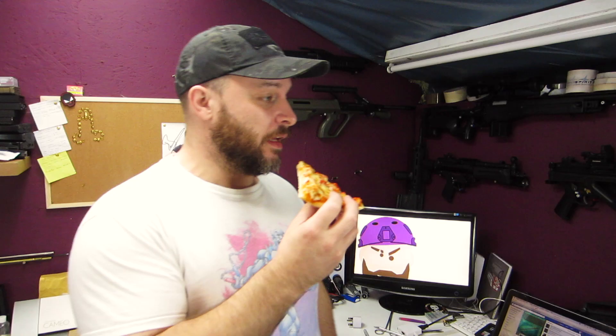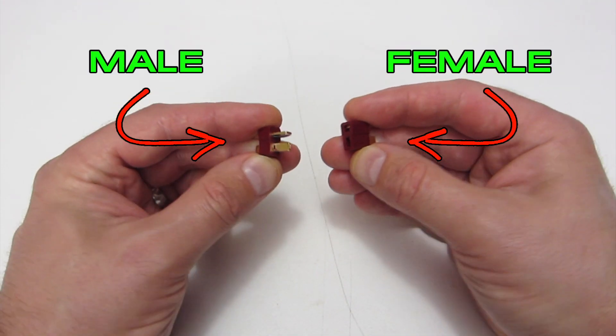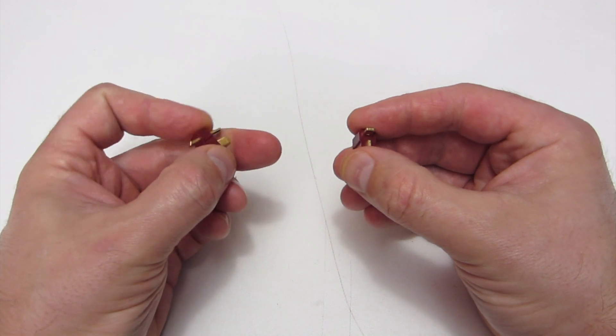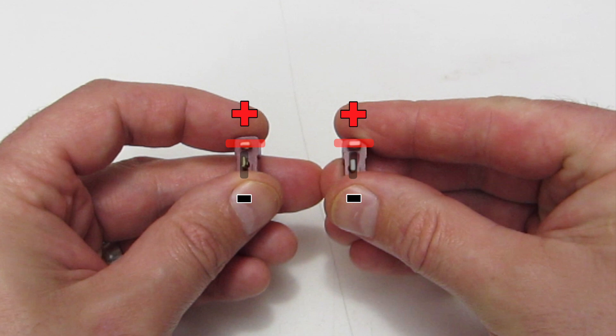That is the same for any basic soldering job. It's different when you come to fine electronics, but this is just the basics. And if you are working on airsoft guns, the electronics and wiring in there is very simple. One of the most common jobs people ask for in airsoft is changing the old-style Tamiya or mini Tamiya connectors to Dean's connectors. The Dean's connector is just a more capable connector electronically, and it's more up-to-date with the higher-power batteries being used with airsoft these days. They come in two parts — a male part and a female part — with the female part commonly used on the battery so there's less risk of shorting out. Polarity-wise, you want to solder your positive cable to the top of the T and the negative cable to the upright of the T. The principles are exactly the same; there are just a couple of things to look out for. I'll run another piece of video showing how that's done and sum up a little bit at the end.